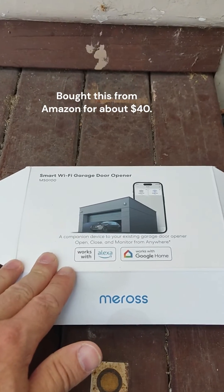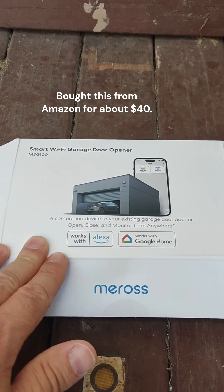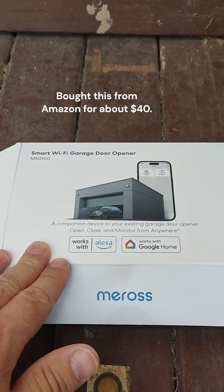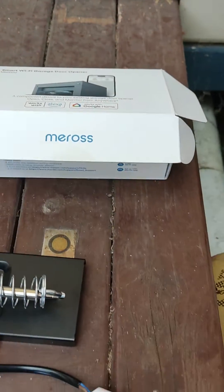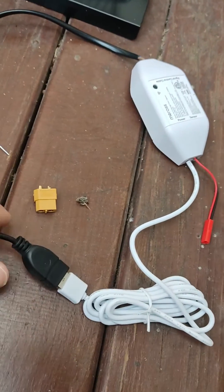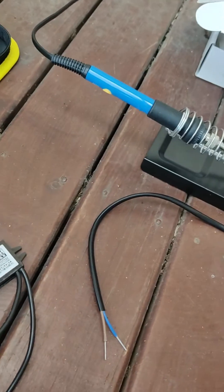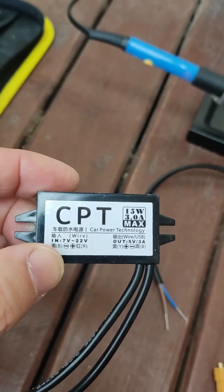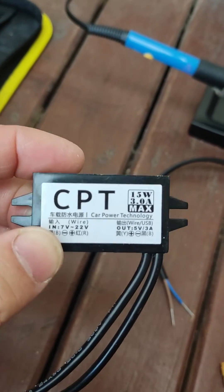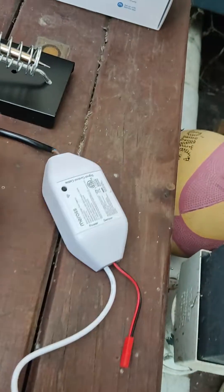This is the unit I'm going to try to get working on my gate opener. It's designed as a garage door opener, but I'm going to try and get it to work on my gate opener. As you can see I've pulled it all out — this is the unit here. It's got a long wire and a USB connector for the power option. What I've had to do is get a 12-volt to 5-volt output converter, with 7-volt to 22-volt input and 5-volt 3-amp output to try and power this unit.